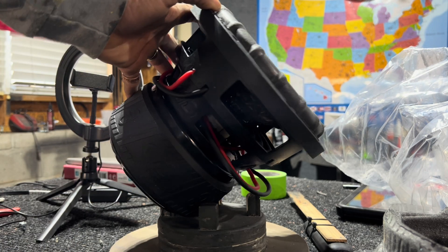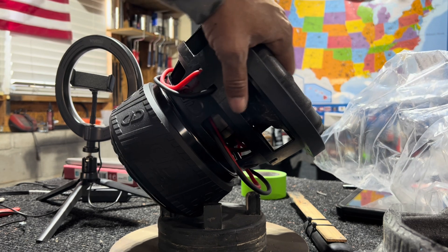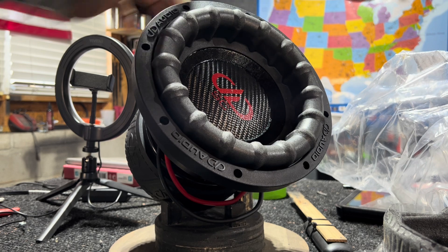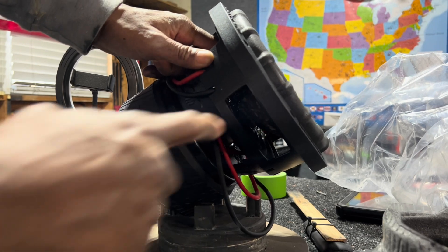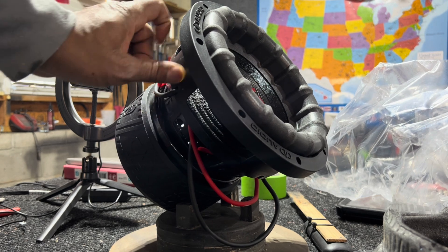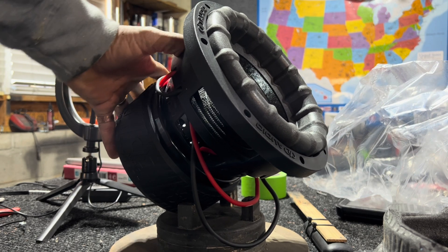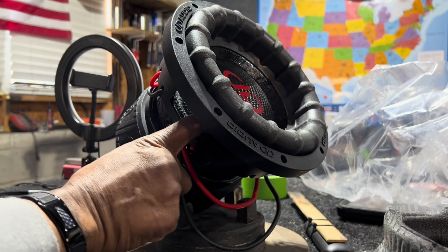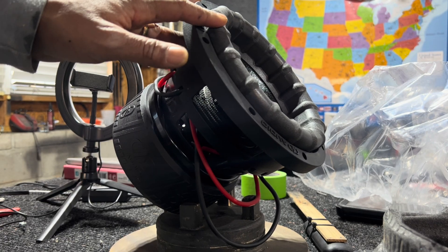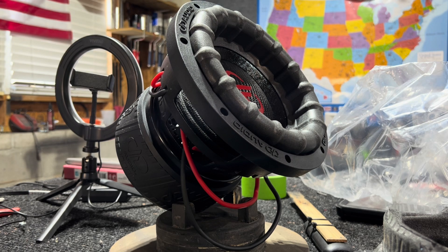I'm showing you just how great this subwoofer is, because I'm taking him through there — dragging him. And this is a fresh one. As y'all can see, that's the iron cloth spider — that joint is stiff. Can y'all see that? Put my finger right there — that boy is stiff, man. He doesn't just move in because you want him to. He's very stiff. I've been breaking mine in, had this pair in there for a while, but I don't have a long commute so it's taking time to really break him in. With even more power going to him it'll go faster. I'm going to get this one tuned for 29 hertz — I'll see you next time.